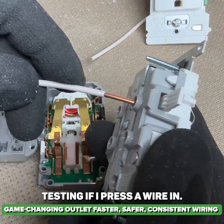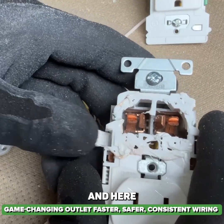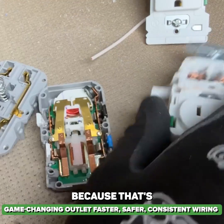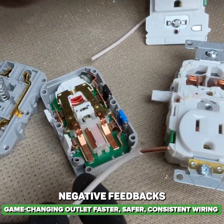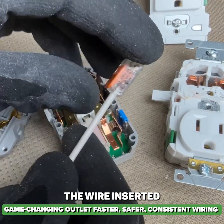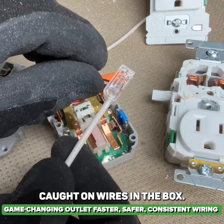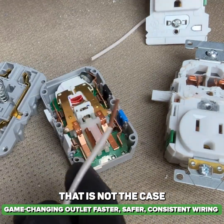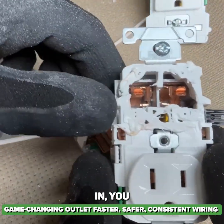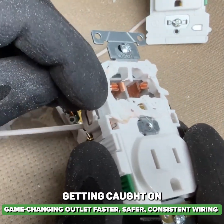Now, one thing that is worth testing: if I press a wire in, does the lever open up? Here the lever has some spring, so it's not going to just sit open. Why do we test that? Because that's one of the most common negative feedbacks on a WAGO lever nut — once you have the wire inserted, there's some play on the lever. You can see how that doesn't spring back, so it can kind of get caught on wires in the box. That is not the case with these edge series devices. With a wire in, you still have a spring that's going to bring back your lever, so these are not sticking out and getting caught on things in your box.